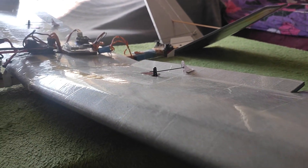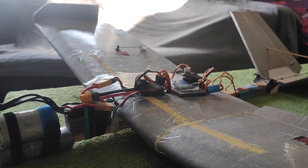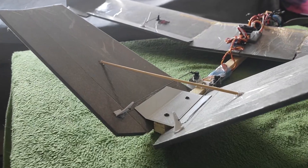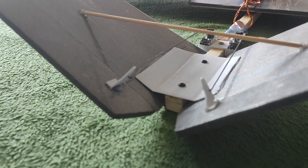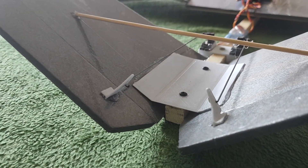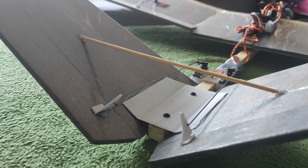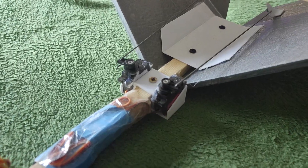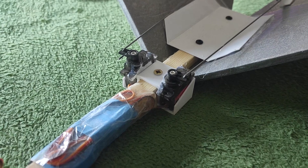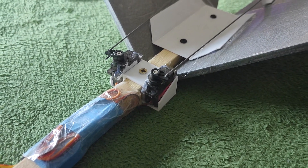The wing construction itself is a flying wing from experimental airline technique. The V-tail is just two pieces of depron glued to plastic holders, which are screwed to the wooden profile — the fuselage. So if I break it, I will just unscrew it and replace it. For servos I also 3D printed a holder which screws on, so anytime easy replacement.